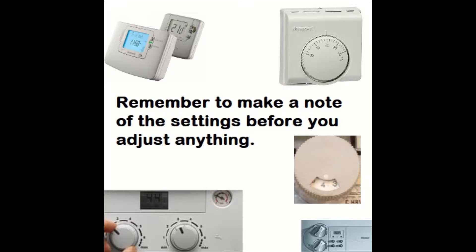Make sure you make a note of the temperature settings — or take a photo, I find that's easiest — or any programs that you've changed, or hot water temperature, so you can set it back at the end when you finish the service or whatever job you're doing. This will avoid the customer calling you up saying the hot water is too hot or too cold — just stops any aggro.